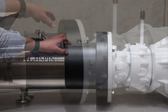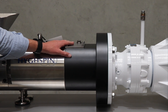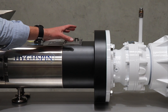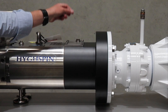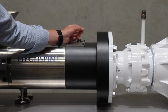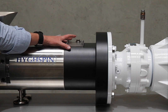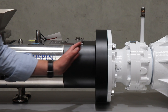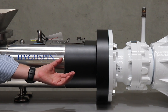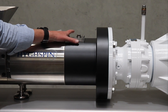This hatch on top of the gearbox is a really cool feature that is exclusive to Jung. The purpose of it is that you can remove it and then reach in to access the timing gears on the shafts. On every other twin screw pump out there, you can't do that — you actually have to disassemble the entire back end of the pump to access the timing gears. In a breakdown situation, that's just stress you don't need. This is by far the easiest system out there.